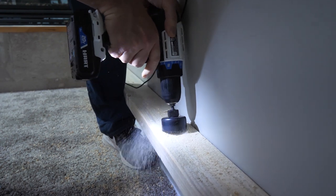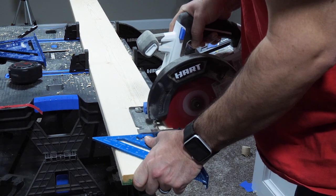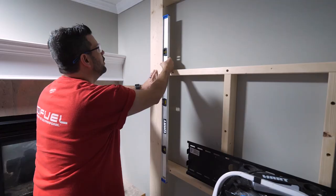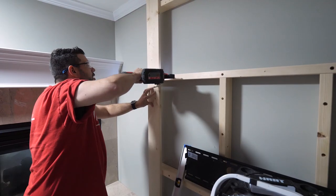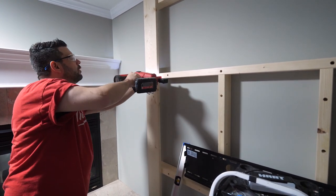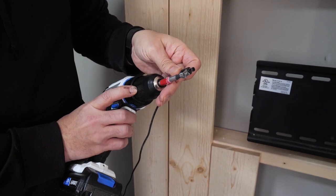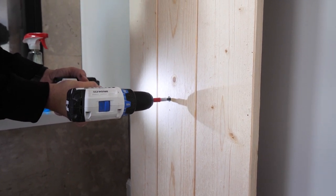Fortunately, they had some deeper Spider hole saws that did a great job. Next, they cut the vertical boards to size — the mobile table did a great job holding boards in place while they cut them with a circular saw. To mount the boards to the frame they used the brad nailer, which worked great. Rob didn't want to glue the boards since he wasn't sure the equipment and lighting would be their final choice. They kept adding panels until reaching where the speaker AC adapters would go, then used a Forstner bit to drill a hole and run the cable while it was still easy to reach.